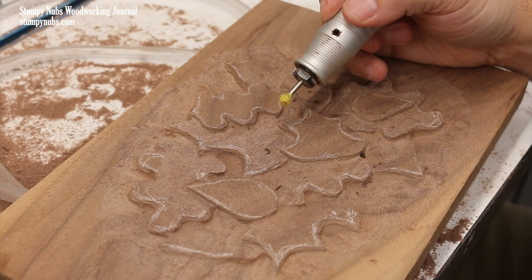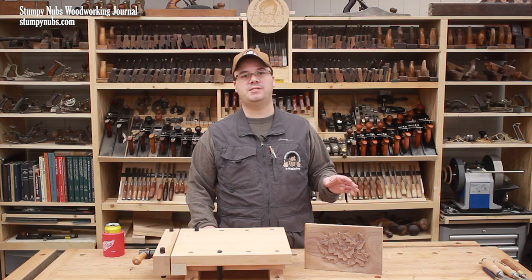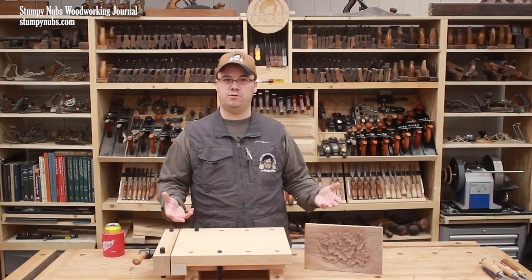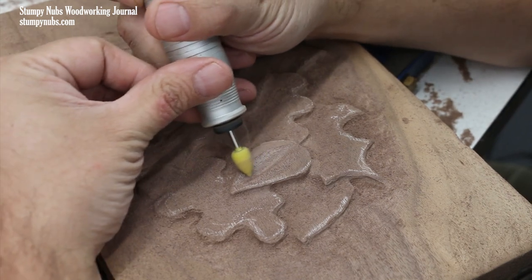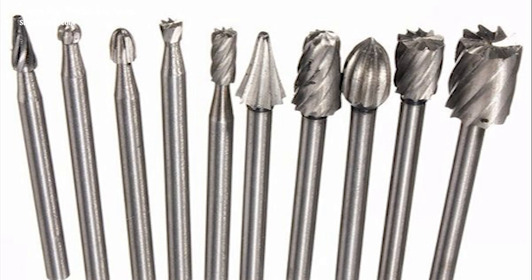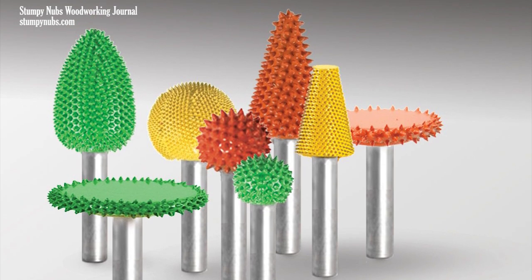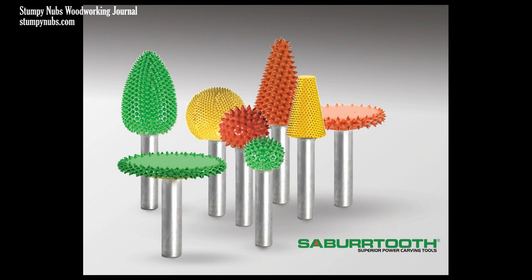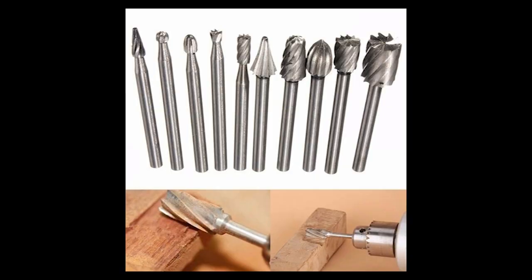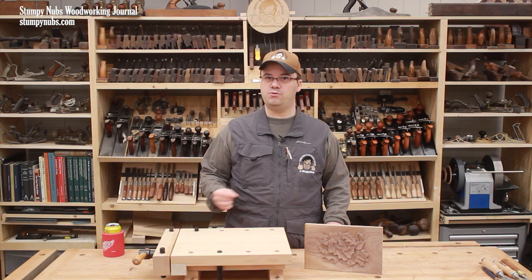It can be a little confusing when I say carbide, because these shear-style burrs are sometimes also labeled as carbide. I'm no metallurgist — I cannot tell you the difference in material makeup between the two — but I can tell you that the shear-style burrs, whether labeled high-speed steel or tungsten carbide, do not last as long as the porcupine-style carbide burrs. I may go through a couple shear-style burrs in a single large carving, but a porcupine carbide bit will last me many carvings. These porcupine-style burrs are like little sanders — they remove material quickly while staying nice and cool. The shear-style bits shave the wood rather than scratching it away, which leaves a smoother surface, but they cut more slowly, heat up more easily, and dull much sooner.